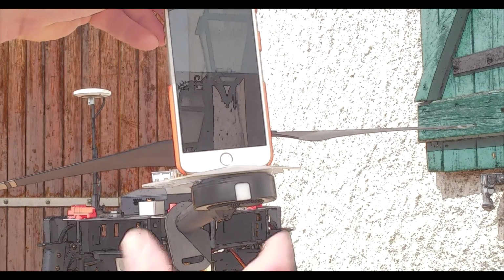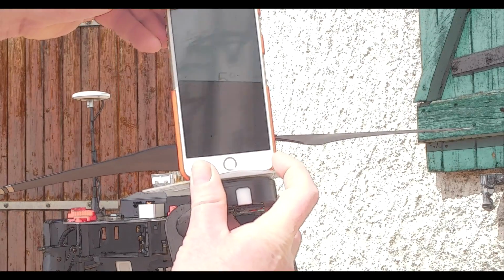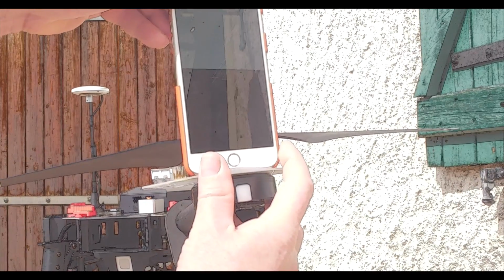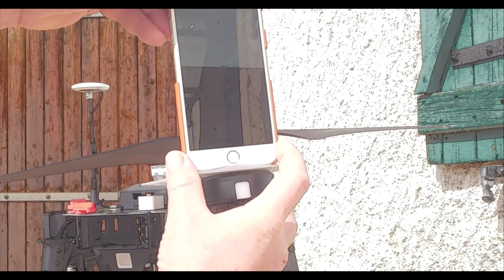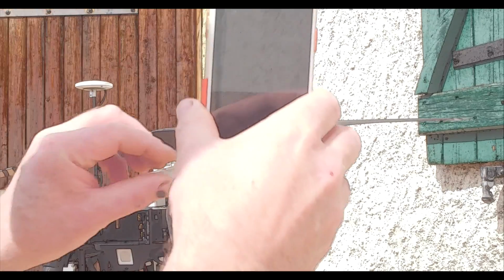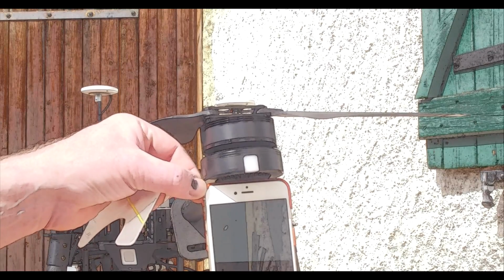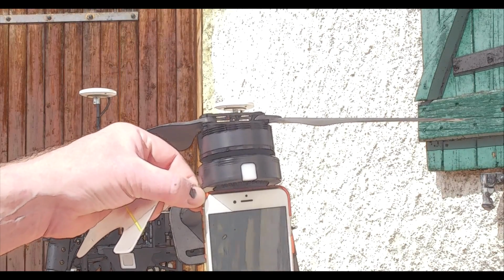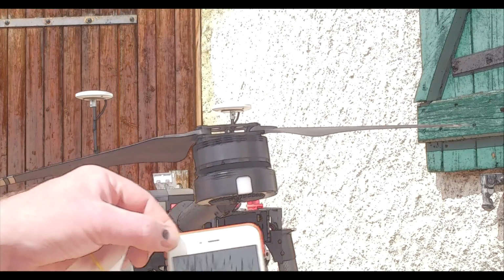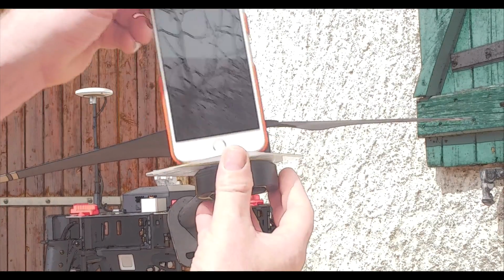backwards and forwards. Now, as you can see, if you're out of alignment, the number will increase one way or decrease the other way. So getting it quite parallel is important, which is why you can do it slightly differently. If you don't use that, the markers you put on the bottom, again, you line up at the bottom, take the measurement and then minus it at the top. However, this does seem to be quite a quick method, easy to make.